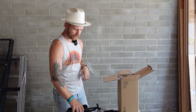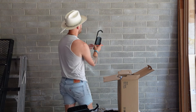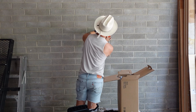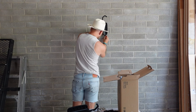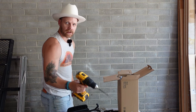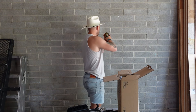That's all the contents of the box — I have four of them so there's four of everything. Now we're going to actually hang the rack. First things first: mark the holes where the rack is going to go. I'm going to hold it up right here — you could use a level if you wanted to, but I'm just going to mark my holes close enough. I've got a concrete drill bit because I'm going into cinder block, so I'll pre-drill the holes.